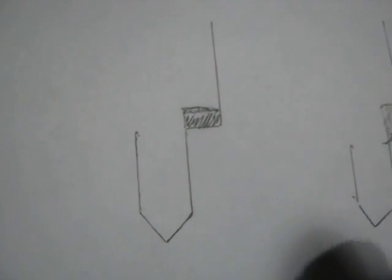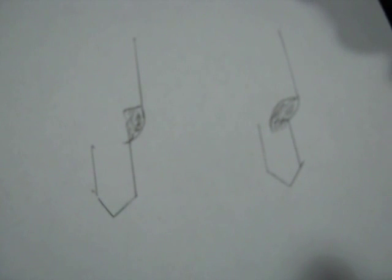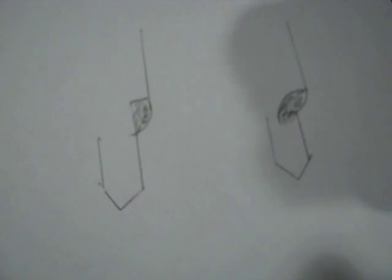A little about the formation of the metal coming down: if I used a flat bottom end mill, I would end up with a chip similar to this at the bottom where it would curl up and then kind of go down. And when you drill it out and clean it, it would be up a little bit. I've chosen to go with the ball because the chip will start going down when it sees that ball, and hopefully we'll fill up that area and everybody will be happy.